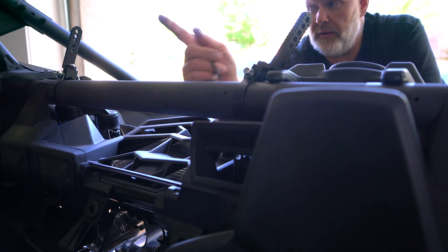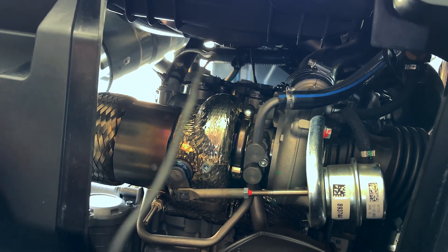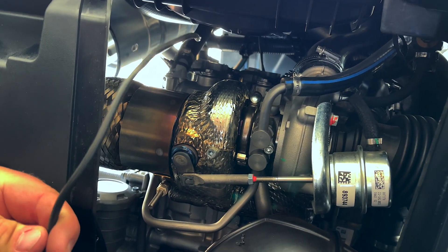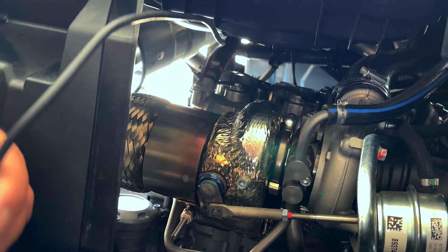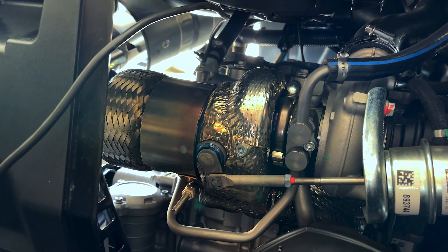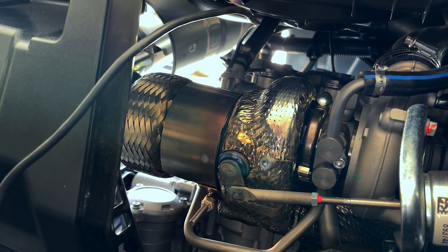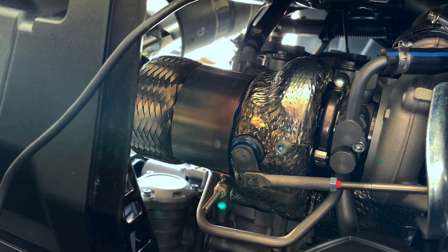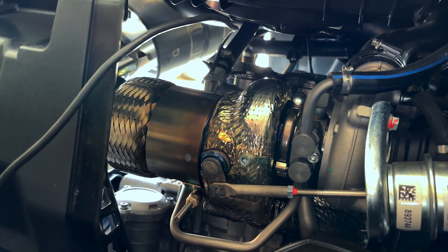We'll get the S&B filter installed and then we'll go from there. We're looking through the back of the machine at the front of the motor. We have the turbo right here, and this wire hanging in the middle is an ignition sensor provided by S&B. Basically this tells the fans in the particle separator how fast to spin based on the RPM of the engine. They tell us to clamp it down to the coil pack on one of the cylinders — it's a very tight space and it took both of us a little while to get it attached. But once you do, the rest is really easy. Word to the wise: they send you instructions, but it's basically just a crappy YouTube video that doesn't tell you really anything about how to actually do it. So shout out to S&B for that wonderful guidance — we figured it out, you guys will figure it out too.